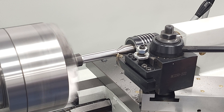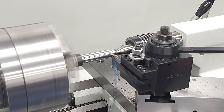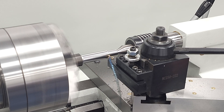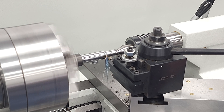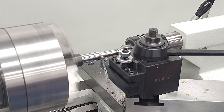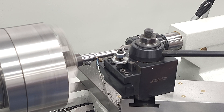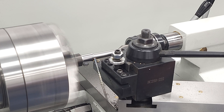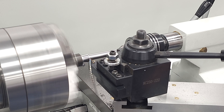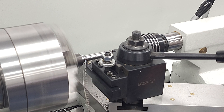Here's our second attempt at 70 thou depth of cut. We left the spindle speed the same but cranked the feed from 3 thou per revolution to about 5.5 thou per revolution. It still didn't break a chip but it did wrap the long string of chips to the side and out of the way, and that chip color was still a nice blue, so we'll call it good. In testing before shooting I found that the cut looks basically identical to this up to about an eighth inch depth of cut — that's 125 thou. Let's get to the good part and do a cut that's too big.